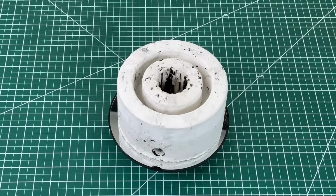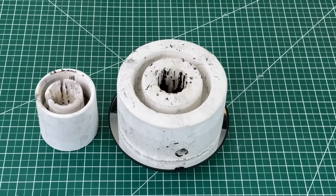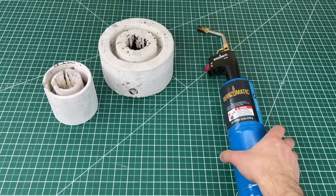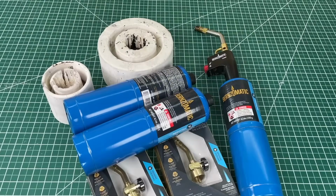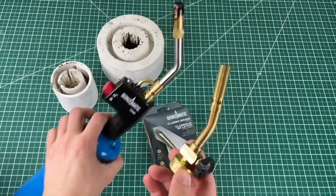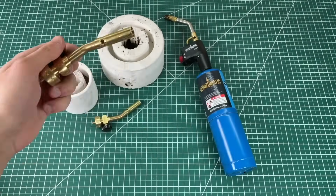The medium foundry looks awesome, and as you can see, relative to our small design, it's much larger for the same size crucible. We can hopefully expect it to last much longer. Now let's invest in 2 more propane torches from Home Depot. You can also get these on Amazon for super duper cheap. We just had to make sure that the nozzle is the same size or smaller than our original to ensure it fits in the foundry's holes.